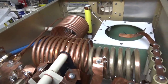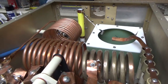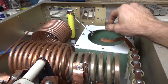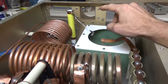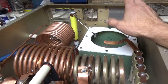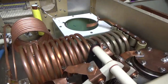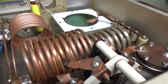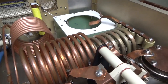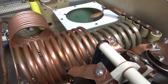I'm going to run it like this for now. The tube will never get close to its maximum temperature for the seal — the first ceramic-to-metal seal. I have to look at the spec sheet, but I believe it's around 200 Celsius. Nothing in here will get even close to the max temp. The intake temperature will be limited to a certain temperature. I'll have a thermal switch in the bottom cabinet, so if the room gets too hot, it'll shut down — blower will continue to run, the filament will shut off, everything shuts off.